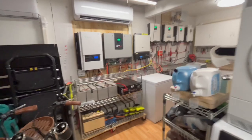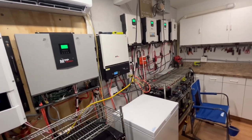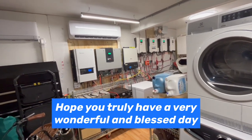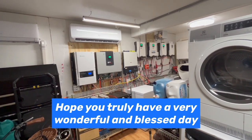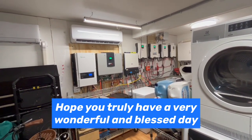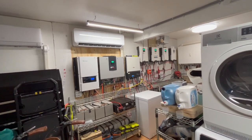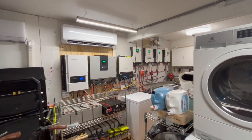We used to plug in things to charge the batteries. If we wanted to run something overnight, we could charge our battery and run the same thing — like a mini split overnight at the same time — and have our batteries completely charged when we wake up in the morning. And it's a lot cheaper to run that one mini split than a three-and-a-half or four-ton, because those mini splits are only one ton, which is 12,000 BTUs, at 120 volts. Running it overnight, we'd probably average about four to six amps, then drop down to two to three amps once it gets to temperature, keeping the room cool. It doesn't use very much electricity once they're cooled down, so much cheaper to run at nighttime than on central air.